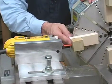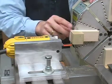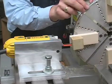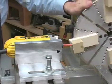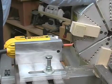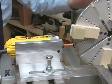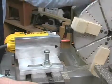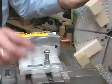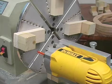We're going to start by trimming the outside of the jaws, and if you were going to do a 12-inch rim, you might have to take them all the way down to there because you'll need the clearance at the bottom of the lathe. This lathe has about a 14-inch swing, but the blocks take up some of that. Now we're going to do the same for the inside of the external jaws.